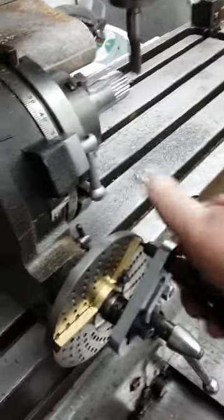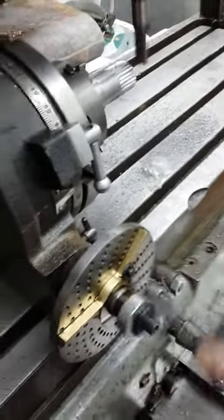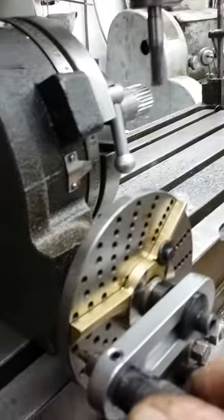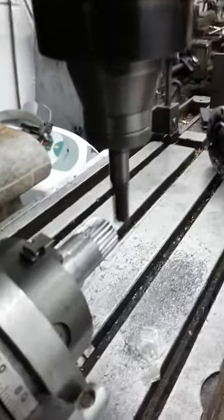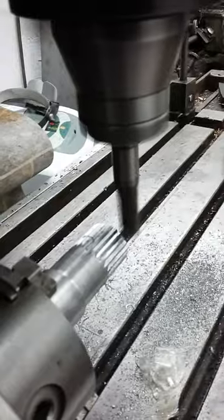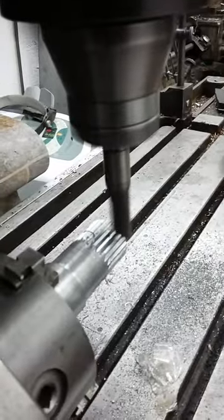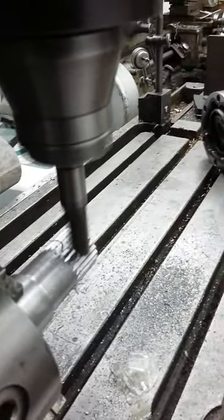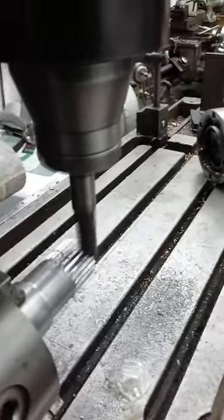It's time to move to the next position. We unlock the table, pull the detent out, take three complete turns — one, two, three — and then I need the additional 12 holes, which is round to the back of this finger. So now we've moved 3.6 turns around and we can feed this in and hopefully take the next cut. We're only taking about 10 thou off this time, just bringing the spline down to size. I'm actually cutting into a hollow bar, just because it was a piece of scrap I had around. It's very close to going straight through.